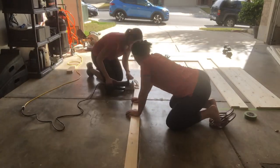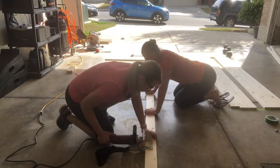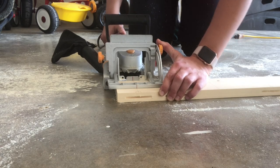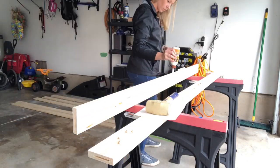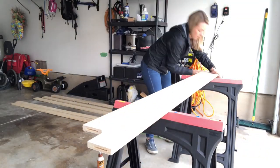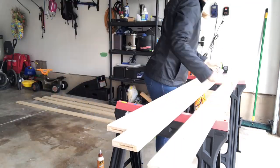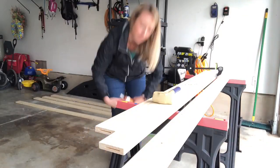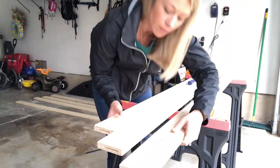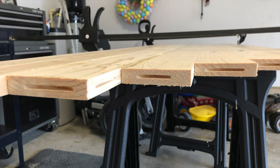This tool is very easy to use — I can do a tutorial on how to use it in the future. Just make sure all of your lines are measured and lined up, then get the tool up to speed and place it into the wood. Next step was to place all of the biscuits — I ran a bead of wood glue down the length of the board into the slots, topped each biscuit with a little glue, and then used clamps to pull the pieces together. I let them dry overnight, doing this with each side of the table.